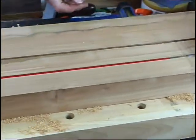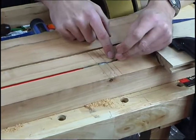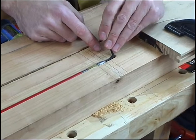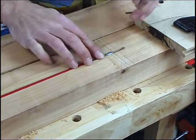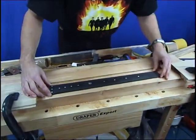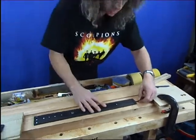We can get our Allen key in there — it's wide enough. This slot is wide enough so that you've got the angle to be able to turn it, withdraw it, and move it to the next position. The fretboard will then cover up the truss rod and most of that slot, and then you've just got enough access there to turn it.